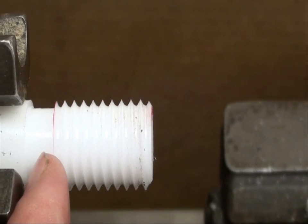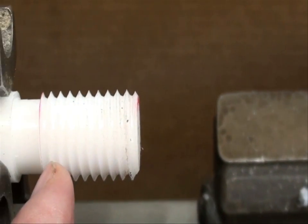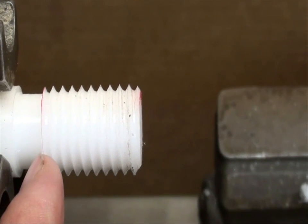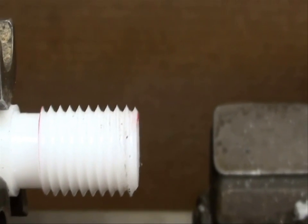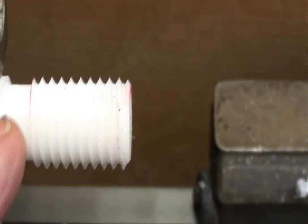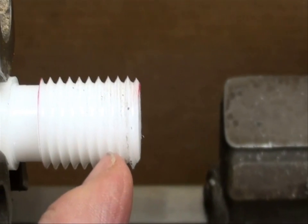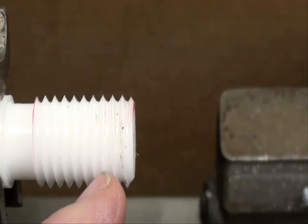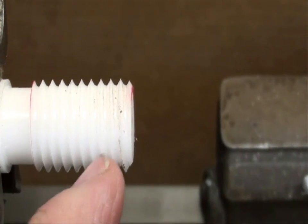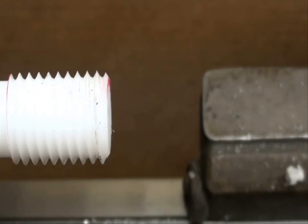What they're saying is just put it in reverse and go all the way back out. Well, when you do that, you have a certain amount of backlash in the carriage, the lead screw, and the gears and everything else. So as you reverse it, you're not truly tracking the thread — you may think you are. Also, it may tend to dull the tool when you're cutting steel. So those are my reasons for not doing it that way.